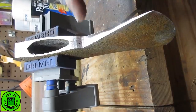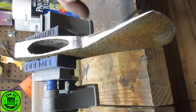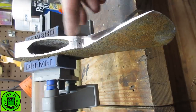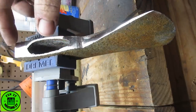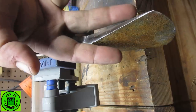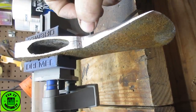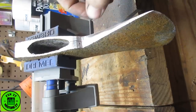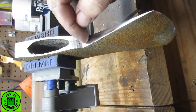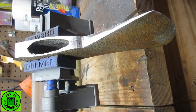I'm trying to show you where it's forge-welded — you can see that dark line up there. What they do is use mild steel, fold it over like this, and it encapsulates the high carbon steel of the blade. If you look right here, you can see a discoloration but there are no cracks or anything, so this may well have been there from forging. It's not a structural crack, so I'm not going to worry too much about it.